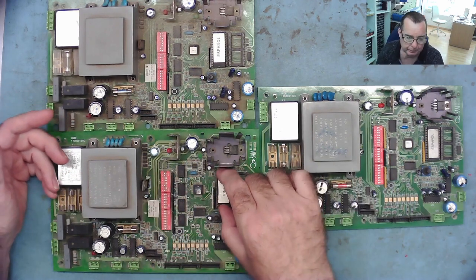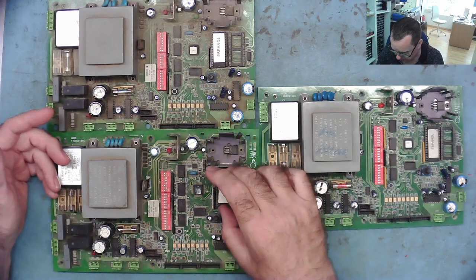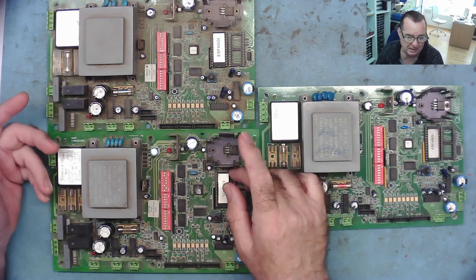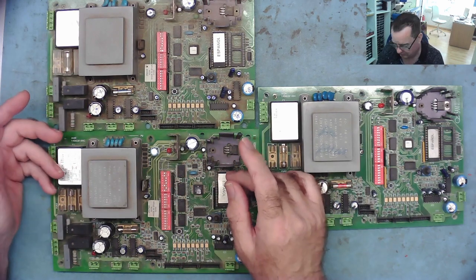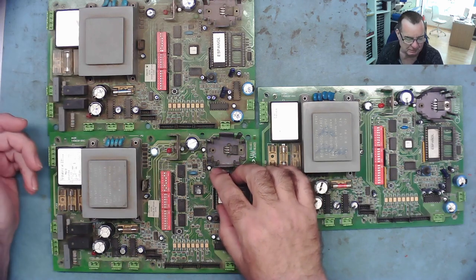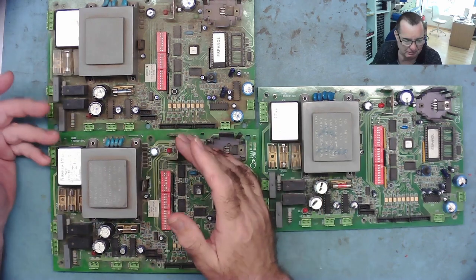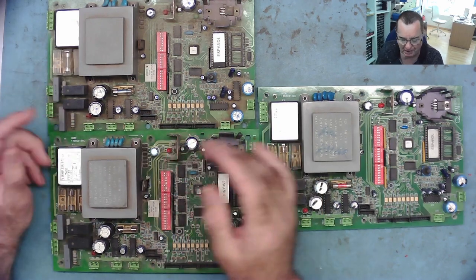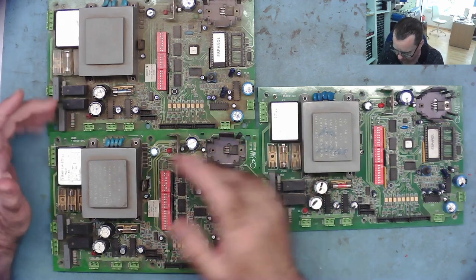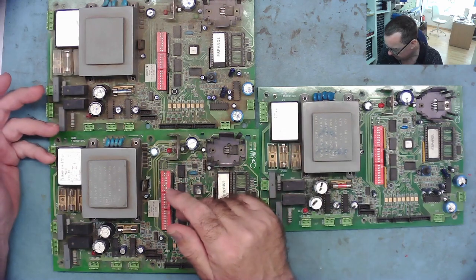So what I tried doing is, I took out the EEPROM, powered the board up without the EEPROM in, and the display says 0, 0 on one side. I think it said something else on the other side; it should be 0, 0 on the other end of the table, basically. Fitted it back in, and I got random half Chinese characters, that sort of thing. So it appears to be something like the processor's not running, or it's crashed.